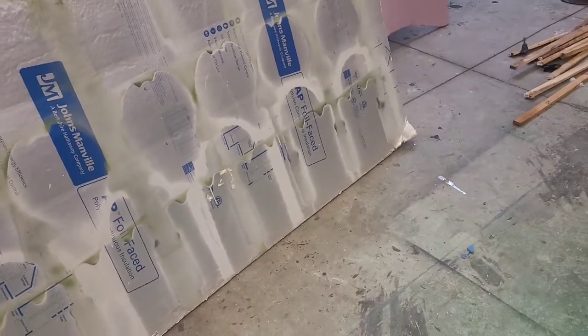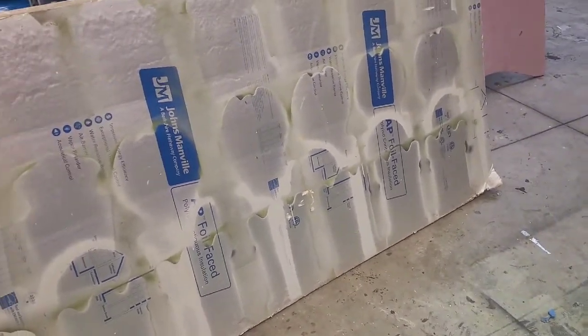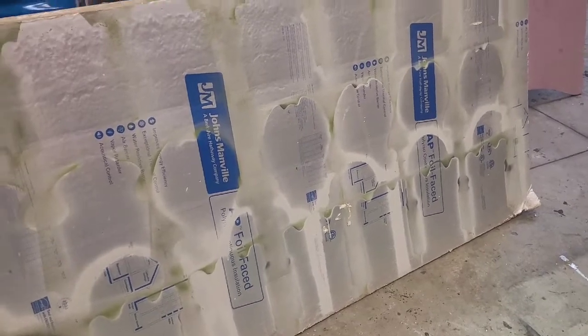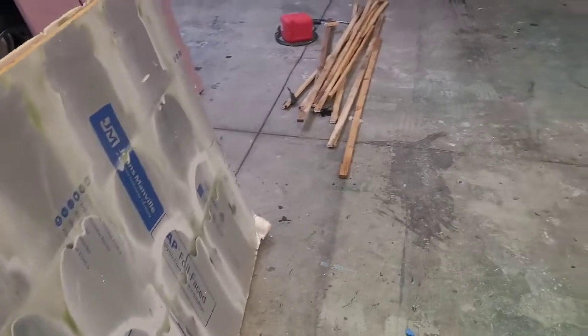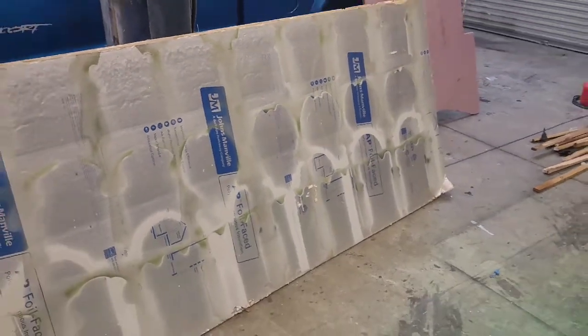So if you have it sitting out there in your front yard and you don't put some kind of reinforcement behind it, which, since I'm going to do the brick, I'm going to be peeling it off where the brick's at. So I'm going to be gluing a couple pieces of 1x2s to the backside as ribs, so I don't get that buckle. As I've had it happen in the past, that's why I'm going to show it.